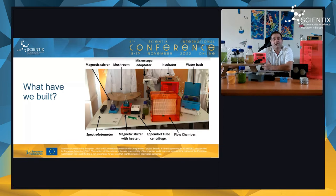We also built an Eppendorf tube centrifuge. The casing is 3D-printed in PLA, and inside we use a drone engine running at 9,000 revolutions per minute — fast enough to separate cells. Our centrifuge costs around 30 euros, compared to 400–500 euros for a professional model.